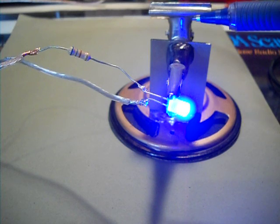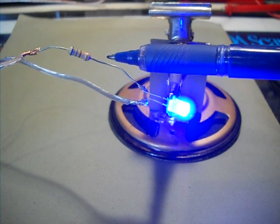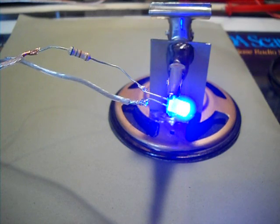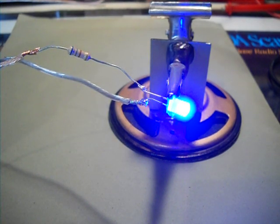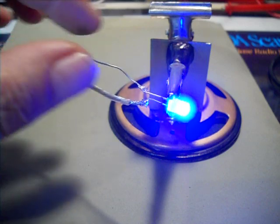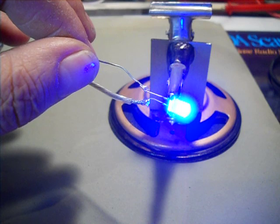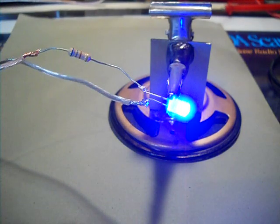I went over 700 — like I was almost 800 or something like that. The resistor was getting hot. I put a 1,000 ohm 1 watt resistor and it got hot, because you've got to remember, the more resistance you create, the more heat you're going to create. Now I've had this on here for over an hour — it's coming on to past an hour and a half. This is not hot. I'm not going to build this and put it in there and just have it burn out the LED or the resistor get hot. There's just a slight amount of warm.